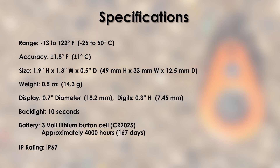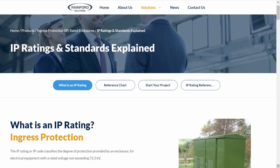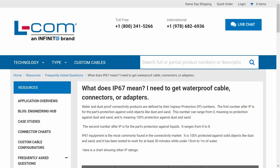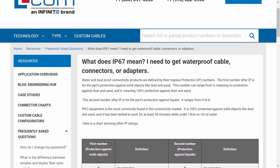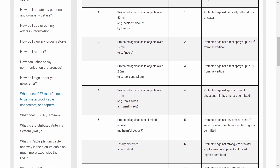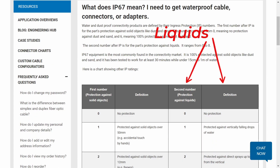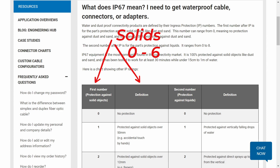Now, if you're not familiar with that term, let me explain what it means. IP rating is an abbreviation of Ingress Protection Rating, and that is a standardized rating system that indicates how much environmental protection an enclosure provides to the electronics and components inside the rated enclosure. The rating consists of two numbers, the first for solids, and the second for liquids.